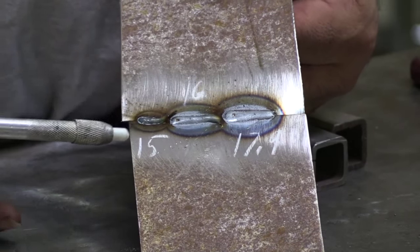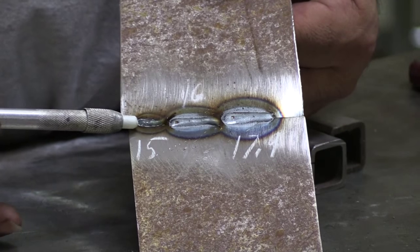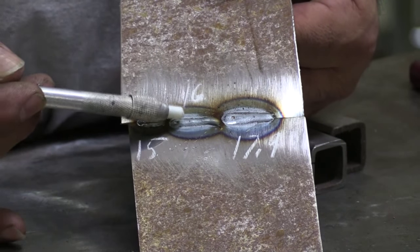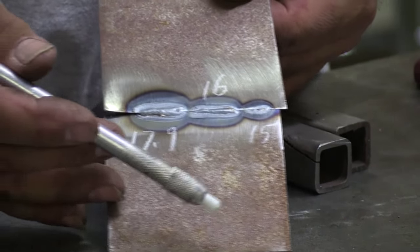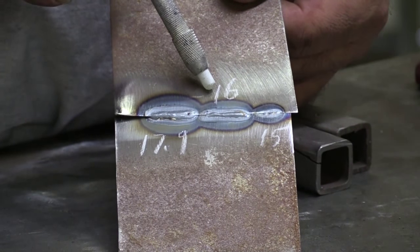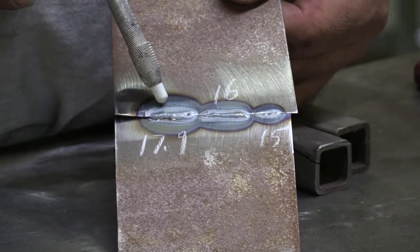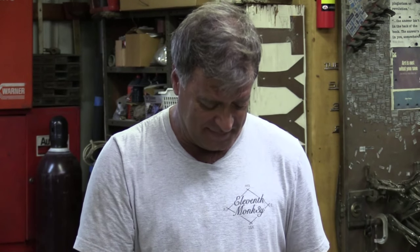This is what I did before — little dabs at 15 volts, 16 volts, and 17.9 volts. Flip it over — you can see the 15, 16, to 17.9. That's why I turned it down just a little bit from 17.9; I figured that one was a little bit warm, so let me slow it down just a little bit — but then I got that little wire hiccup.